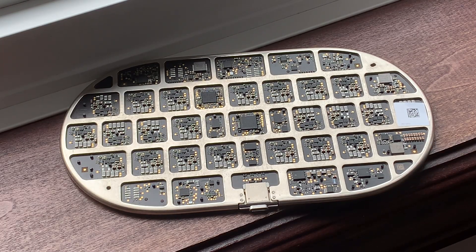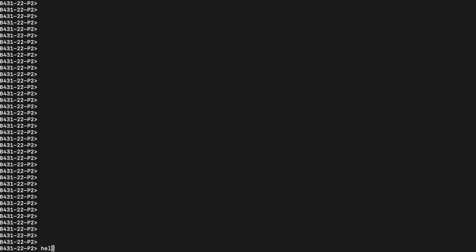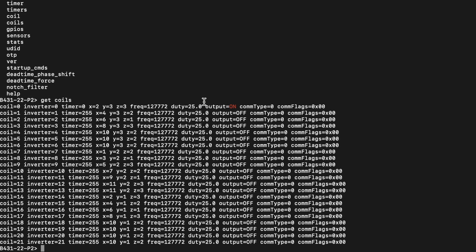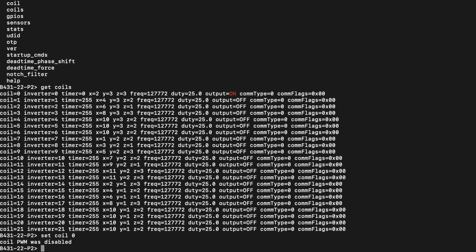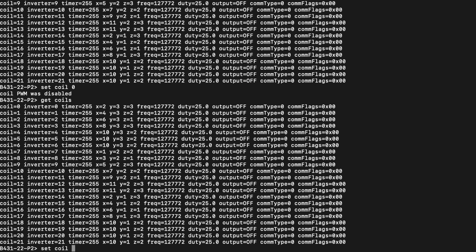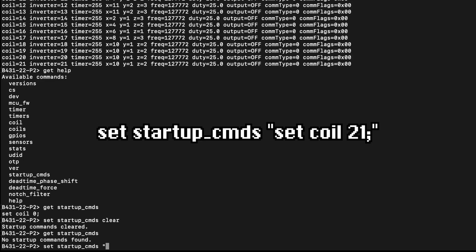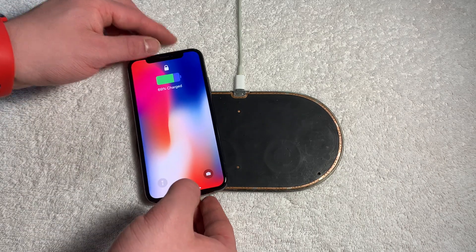Now that's cool and all, but AirPower has more than just one charging coil. Particularly, the prototype AirPower that I own has 22 in total. So how can we turn one of those on? If we go back to the serial interface, we can get more information on how we can potentially do this. Because we have the Set Coil Startup command already turning on, we can see that if we do Get Coils, it says the output for Coil 0, or Coil 1, shows on. We can also turn off this coil by doing Set Coil 0. But what if we did a different number? Inputting 21 instead and then doing Get Coils, we can now see that Coil 21, aka 22, is on. So doing the same steps as earlier with the Startup commands, we can do Coil 21 instead of Coil 0. Now plugging the AirPower back into a USB-C charger, if we put the iPhone on the opposite end, as we can see, it charges it.